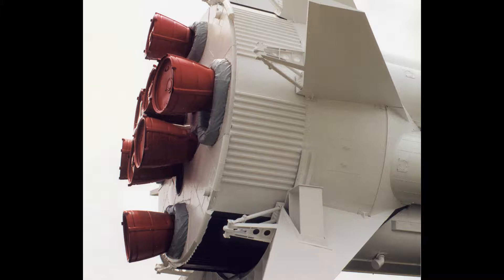When you're doing a scale model, you have to make a decision about how you're going to do the fins. For the full-size Saturn 1B, the fins aren't the main method of aerodynamic stability — they do provide some stability during the initial phase of flight, but most of the stability comes from vectoring the thrust out of the rocket motors. So for the typical scale model, the stability isn't what we need for a flying model rocket. You can do what's called sport scale, where you make the fins a little bit larger — that's what the Estes kits do. Another way is to use scale-sized fins and add extra nose weight to get a positive stability margin. That's what I've done with this rocket, although in retrospect perhaps some larger fins might have been a better idea.